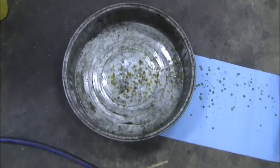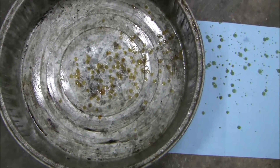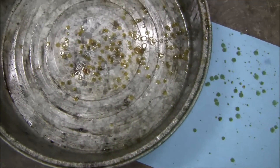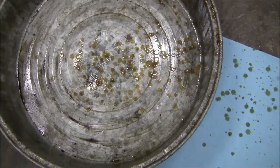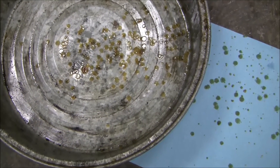Also of note — this is the pan that was underneath the gun that I was heating up with that forced air blower. This is all the cosmoline that ran off of it. By heating it and using gravity, we were able to get all that out. The blower on the heater was blowing the cosmoline away from the pan onto my shop floor, so I laid a towel out to catch it. This is a lot of cosmoline — this would all be hand cleaning if you didn't do it this way. Even if you went straight to the wash tub with all this cosmoline in there, you're not going to get it clean the first or maybe even the second time and you're going to get really fouled water. So I really think that's the way to go on the initial cleaning.